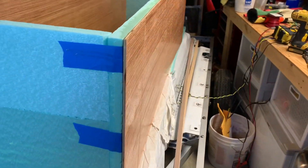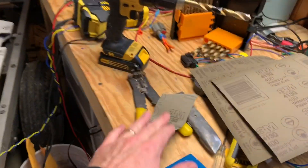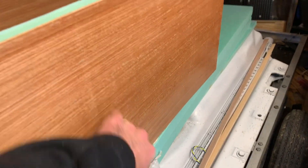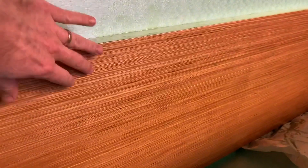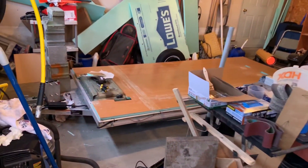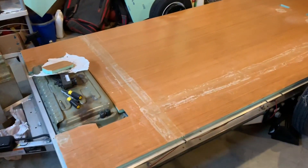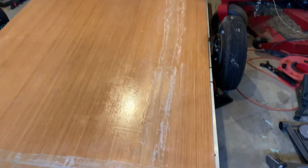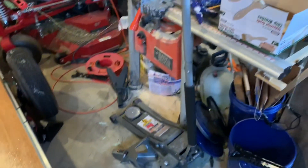I just sanded this stuff — I started with 80 grit by hand, then went to 320 to 400, and it's smooth now. There are a couple raised spots but I think with the second coat it'll be fine. I'm not going to do anything with this one piece, it looks fine and it's going to be inside anyway. I've got the heater going and I'm going to do some more work tonight. This part looks rough and I'm pretty much expecting to see it through the final coat.